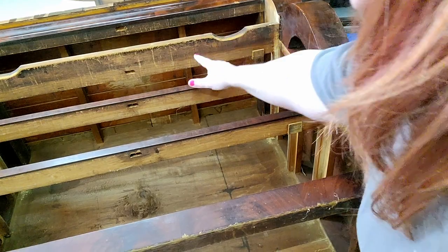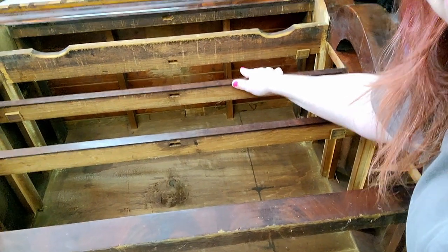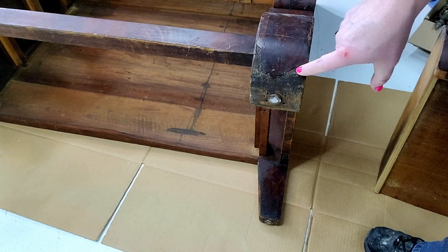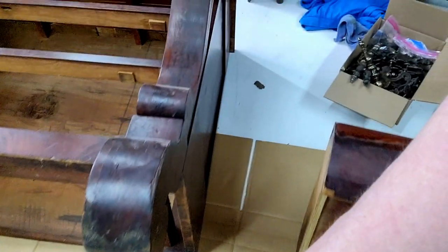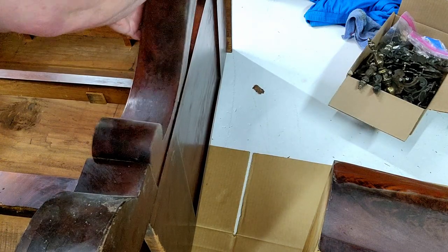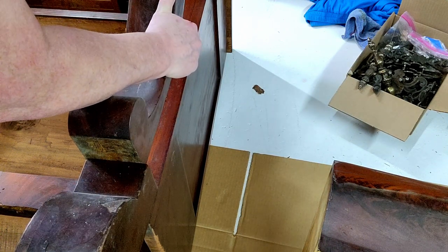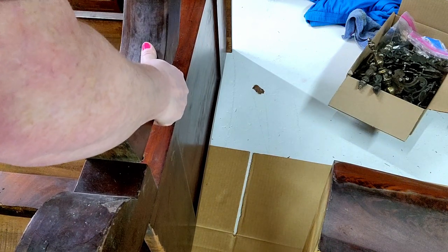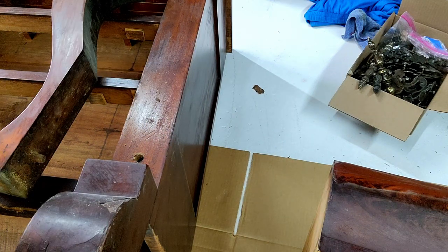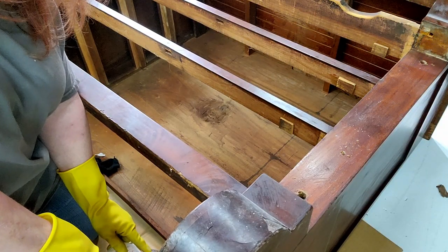As you can see, the top is just planked together — probably tongue and groove — with a veneer over the top. There are a lot of chips at the lower parts, a lot of veneer missing, and then a big piece of veneer missing here that's lifting. We've also got this corbel that's going to want to come out. Nice and gentle, because we've got veneer up there that wants to lift. We don't want to chip any off that we don't have to — but yeah, that's a closer look at what's going on with this piece.